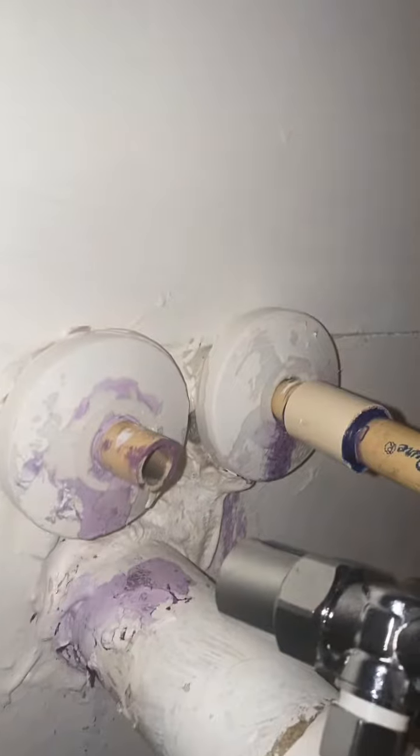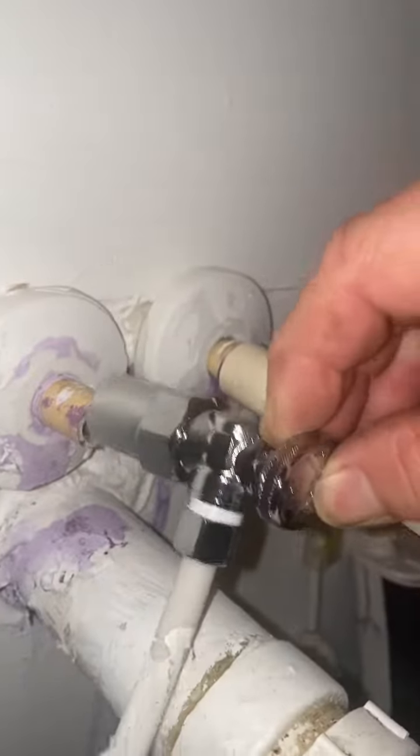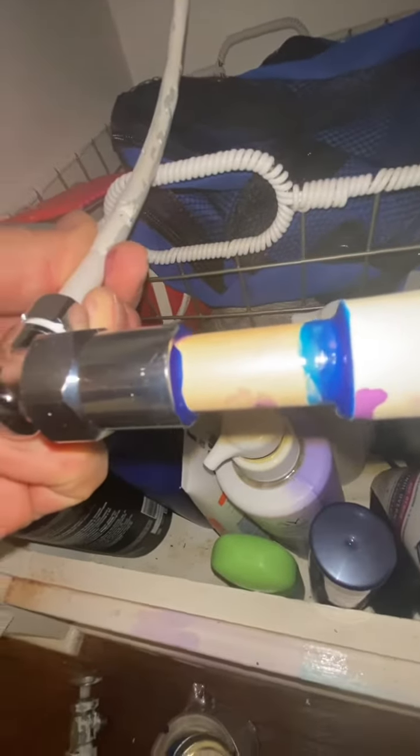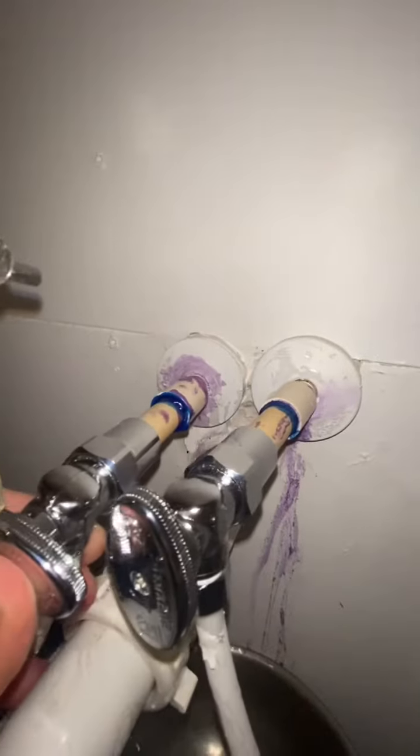Here is the part that's going to save you a lot of time in the future. You can see there's enough of a tip there to push this all the way in, but if you do that and you have a problem in the future, you've got to tear out your entire wall to replace that valve. So what I've done is taken a two-inch piece of CPVC, shoved it inside the valve, and put a coupling on the end. Now when I go to put this on to the back of the sink, I've got space to be able to replace that later if it does break.